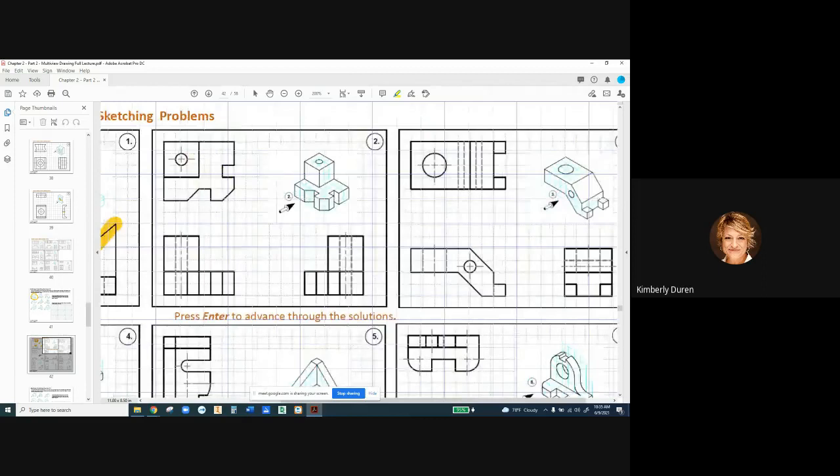On this part, this one is a little bit of a challenge too. This is another one where I might have drawn the top view first, because it has all this profile stuff going on — we need this to dimension all that. Because these cuts go all the way through, we don't need another view to describe these weird cuts and angles on the outside perimeter. We need the top view for the hole, and we need the front view for the height of this step and the overall height. But then we just project these angles and lines down.